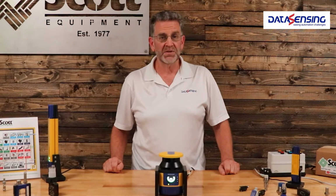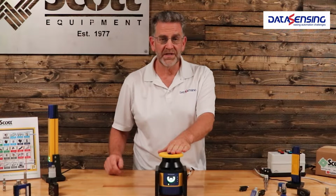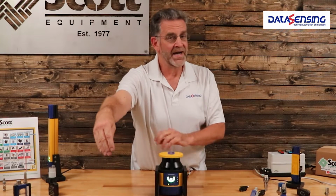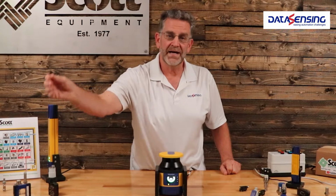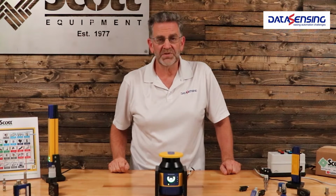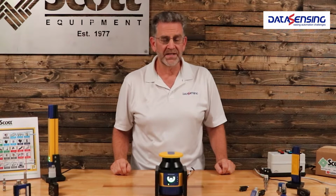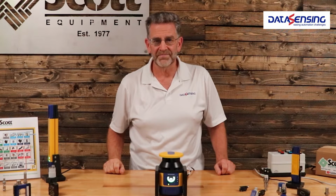If you do have something where somebody can get behind, for example, a column of a building, while I might have this one catching a column that's out here, I'm going to have another one behind that column. While I can see somebody in front of the column, I can't see them behind the column, so I would have to have a second laser scanner on the other side of that column or the other side of a machine. If that's still in a dangerous area, we need a second laser scanner to pick up that person, which is why we have the cascading capabilities where I can daisy chain these up to 4 units deep.